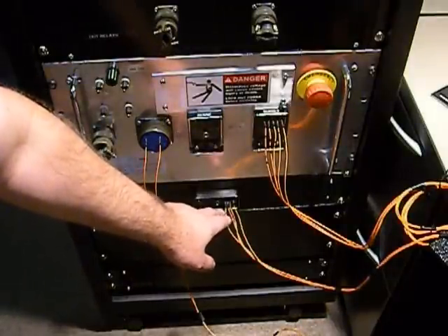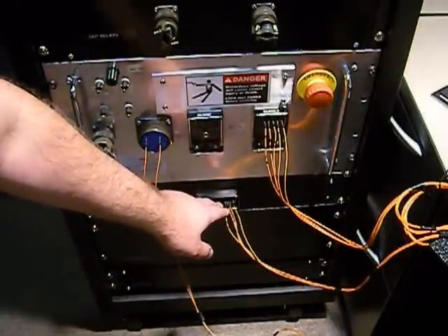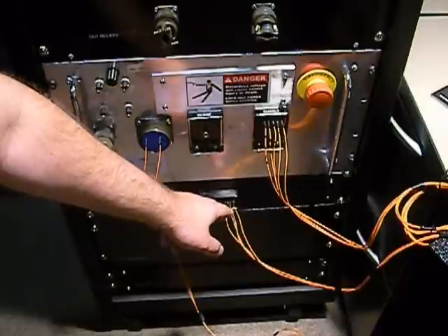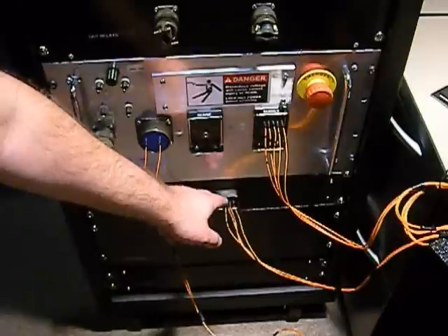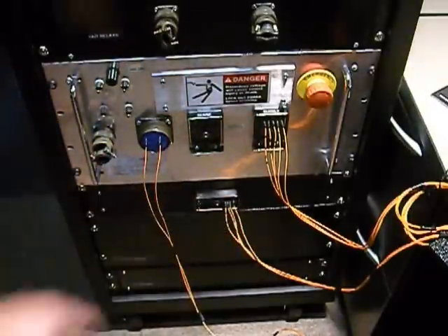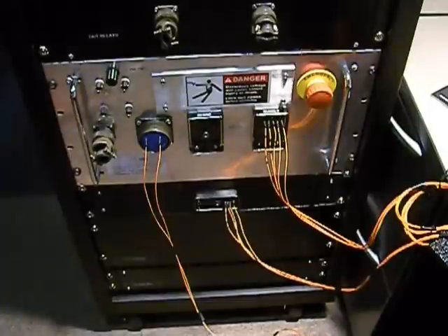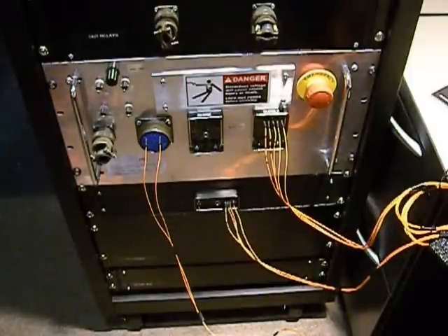Down here you'll see the four sets of leads that are simulating the two thermistors. The 10K thermistors we've removed from the board are now simulated inside this test stand box, where we can pick for these two sensors four sets of individual resistors to simulate open circuit, nominal, high, and low resistance temperature sensor readings.